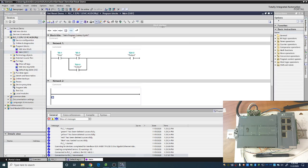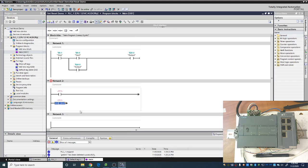So now we can go ahead and do a little comparison here. Now I'm going to break one of my rules, and I'm going to have multiple rungs in one network, which I really hate when students do, but there is a purpose to it, and it's less screen real estate, so that makes our life just a little bit better, for demo purposes anyway. All right, so we're going to just go ahead and do a normal output on both of these.